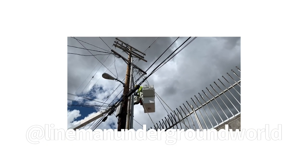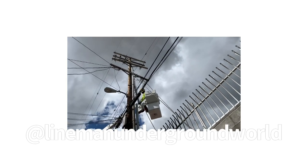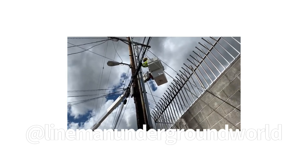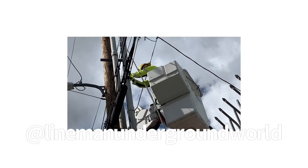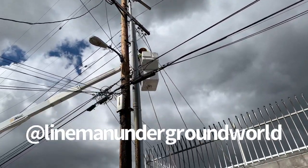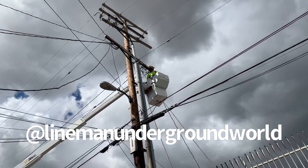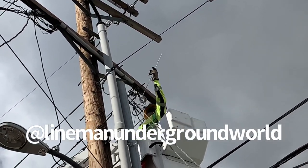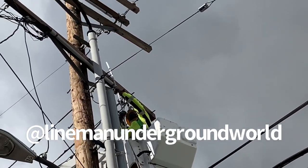Careful with the secondary. You gotta use your man voice when we're out here, pal. Alrighty. Pushing the fish tape through with the rope. And now he's gonna bring it down to set it. Another half a stick and we should be pretty good. If you can give us a measurement on that last piece, all right? He's gonna give us a measurement on the last stick up there so we can get a full and nice accurate measurement.